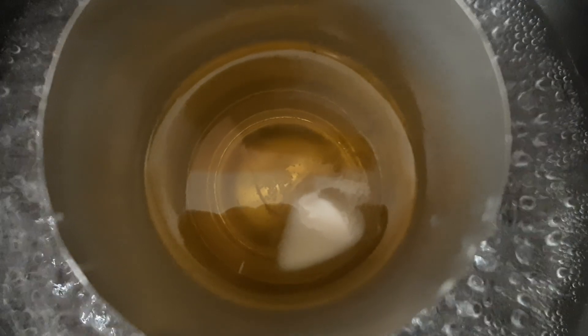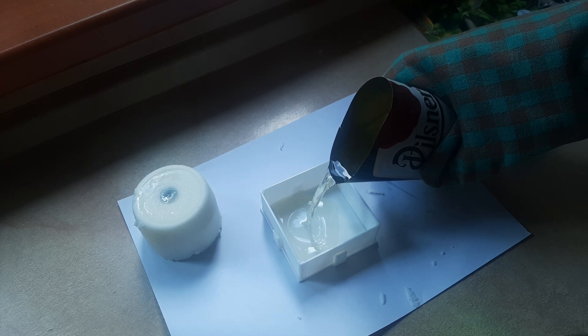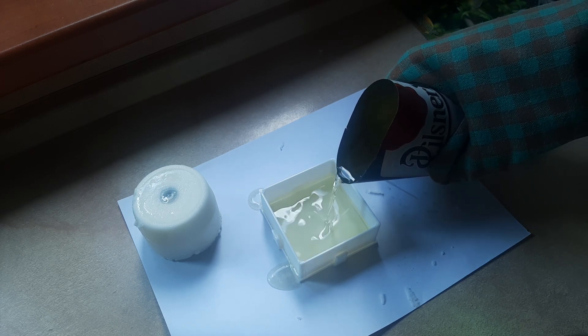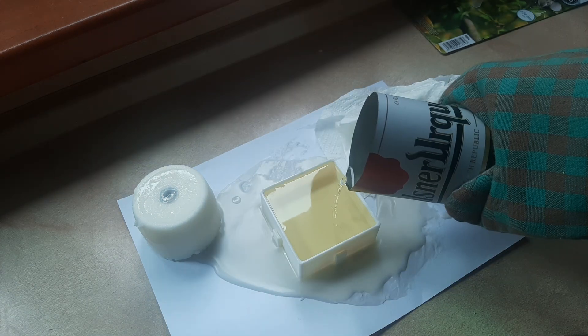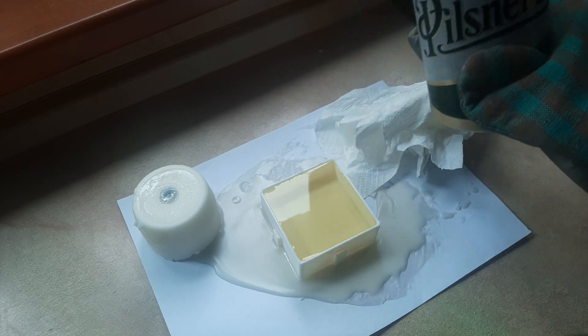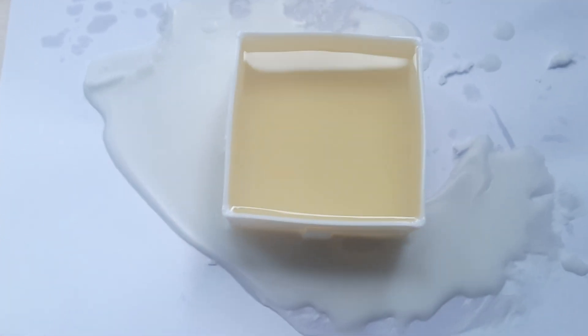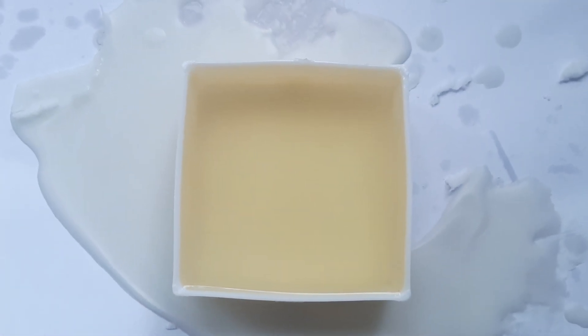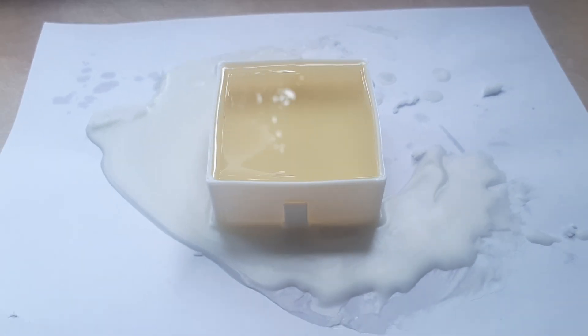After that I made the toolpath smaller and smaller. All the tests went fine, so I started preparing the wax. The mold is made out of two pieces, so I fully expected the wax to spill out a bit. I just let it solidify and then I poured more wax in and waited for that to solidify as well. I noticed that the mold had kind of bulged out because of the weight of the wax, and this may or may not be a problem in the future.